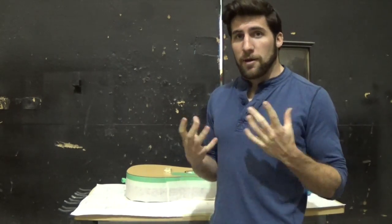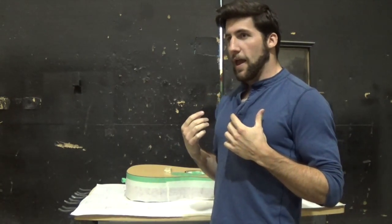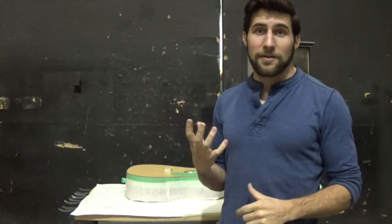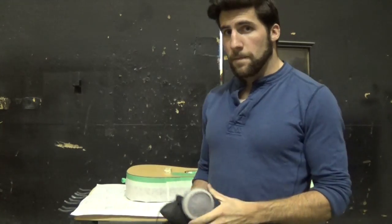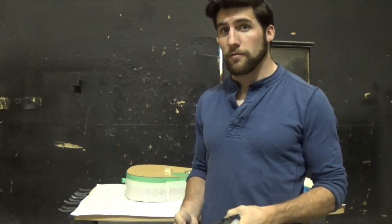If I don't get 100% coverage all over I'm okay with that, because I'm going to be coming in with black and gray after, and I'm trying to keep the finish as thin as possible. I'm going to mask up because I don't want cancer. There are definitely times going back through my videos when I should have been wearing a mask and wasn't. But now I'm going to mask up, mix my paint, and spray — so hopefully you guys like the background music. You should definitely be wearing a mask anytime you're working with lacquer, particularly nitrocellulose lacquer and the solvent-based stuff.